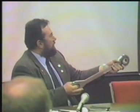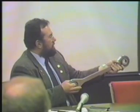I wonder if I could just have a quick peek at this. Of course, under centrifugal load, which is quite big. Now, this was carrying 60 RPM. This was carrying the centrifugal load and not the center spar. The center pipe didn't do anything really. That was there just for feather. That's correct. And this may actually give you a fair amount of damping, the lamination. Yeah, a little bit.